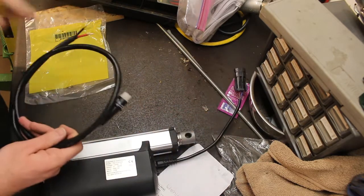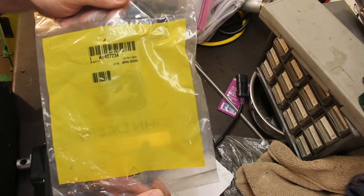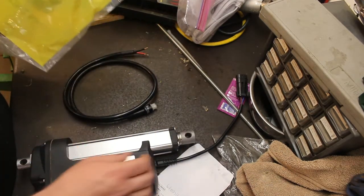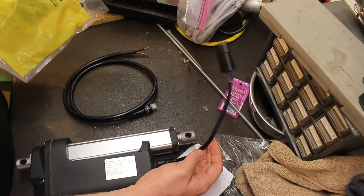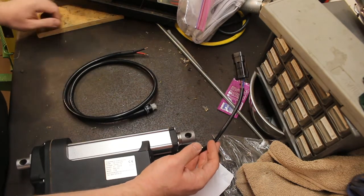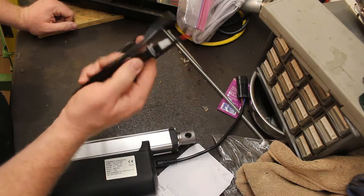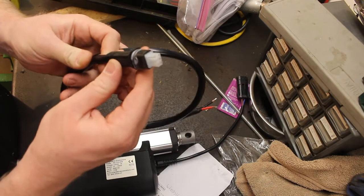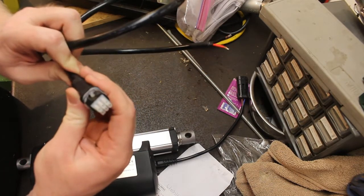As part of the original purchase I actually bought this kit right here — AT407234. This kit actually contains a wiring harness. For about 85 bucks you get this little pigtail right here. I thought it was a full wiring harness from the front of the tractor all the way to the switch, but it is not. It's just a pigtail, and what's special about it is it has this end on it which connects to the multi-pin attachment.